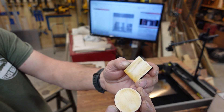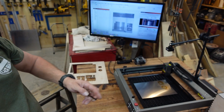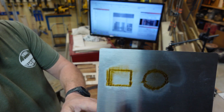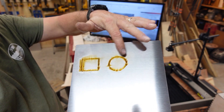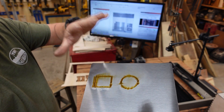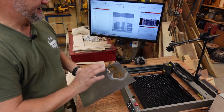And of course this is the back of your pieces, so to avoid the yellowing, always use a proper cutting surface. The one thing this cutting surface does and does well is it provides more than adequate airflow for the gases to exit the bottom. Even on a honeycomb, this stuff will collect and can be re-vaporized if you don't clean it regularly and still stain your material. This is like a tar that comes out of the wood - it's just remnants of the wood, the glue, the moisture, heated up really hot. That is the importance of a cutting surface.